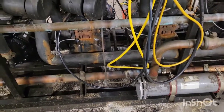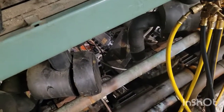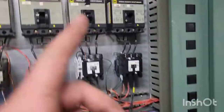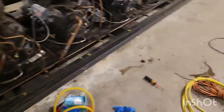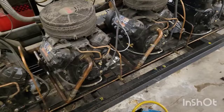That's where you cross that bridge based on what your company does. My theory on what happened here is that as that discharge goes into the compressor, it'll actually condense down into liquid refrigerant. And what happens is that liquid refrigerant will get stuck in that compressor and it'll actually cause it to trip. Because I already took my ohms on this compressor and I found that the compressor ohmed out just fine — seems to be a working compressor other than this. So there had to be something that caused it to trip. That's my current theory on it.